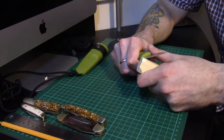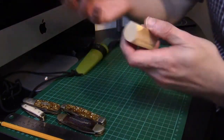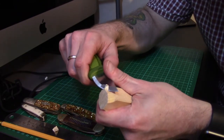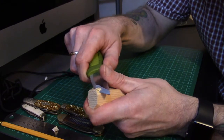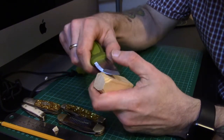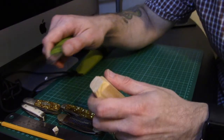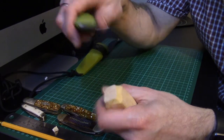What I'm looking for - if you look at it in cross section - I'm trying to make the width of the piece I'm cutting into the same width as the wood that's left where we haven't yet cut, so you get that kind of octagonal section. Once I get to that stage, you follow along those corners and bring them out towards the middle. I'll fast-forward through this footage as I want to keep these videos fairly short - watch me do it and I'll come back when we've made this rounded off as we want.